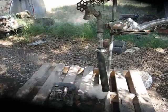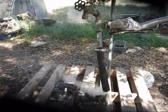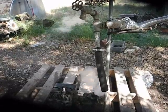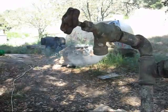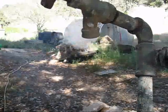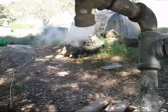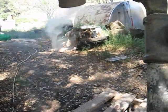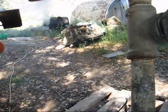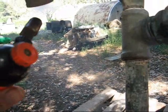We're starting to get a nice smoke from our apparatus. We're going to give it a few minutes and see if it will ignite. We've added a few drops of water to increase steam, because when that steam hits the lit charcoal bed, it should turn into flammable carbon monoxide. Let's see if our smoke will light. Nothing yet.